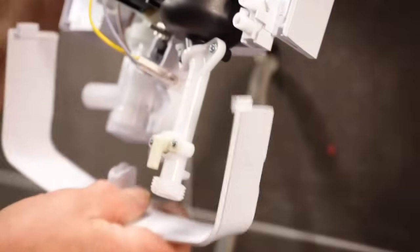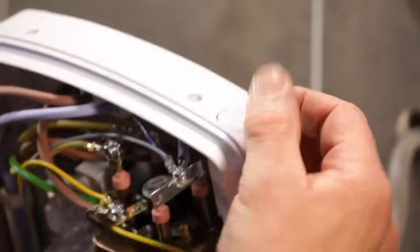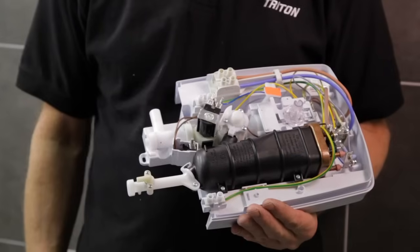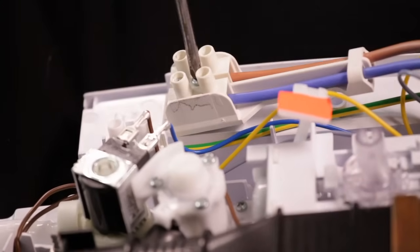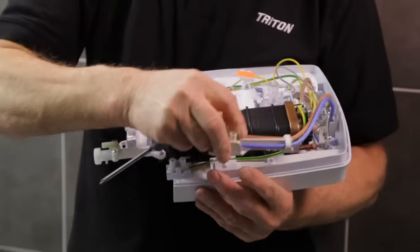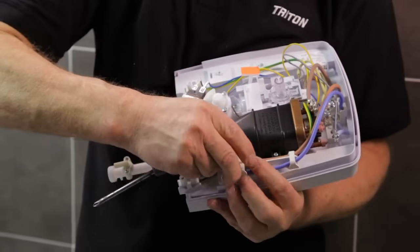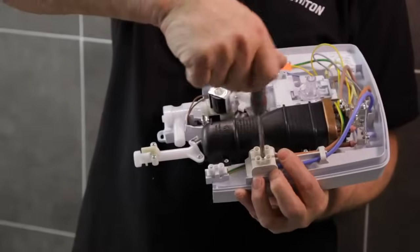Now for the T80Z FastFit. Take off the bottom trim, place and fit the top pipe entry trims. Water connection is required on the right, so adjust the swivel water inlet to suit. Electric connection is required on the right, so loosen the retaining screw on the swing fit terminal and move it over to the right hand position. Now secure in place by tightening the retaining screw.